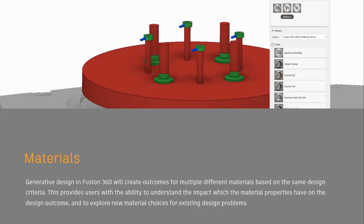Yeah, absolutely. We were going to stick with a polymer, PA12, and we had confidence that the way HP Multijet Fusion applies that material to produce the part is very much different, and we had some confidence that we could produce a part just in nylon alone. Yeah. So in actuality, when we did this, we only used one material type. In reality, for most people, a lot of times there's a situation like that. What we show here is, as an example, 3 different materials. And what the software will actually do is try to create a geometry that is suitable for each one of these 3 materials. And you could actually do, I believe it's up to 8 different materials now. So you could try out 8 different materials.